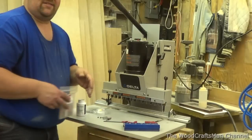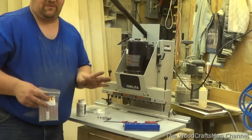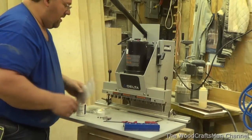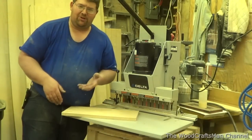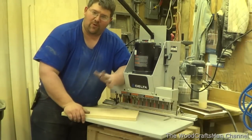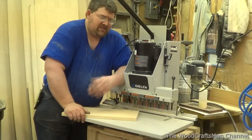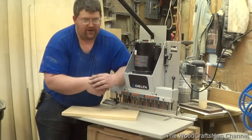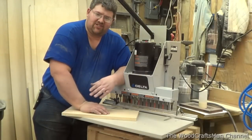So I'm going to set these bits up. If somebody is really interested in knowing how to set the bits up, I can do a separate video on that, but this is more of an overview and a demo. So, alright. Okay, so I've got done setting all the bits. If somebody wants to know a little bit more about setting the bits up, just leave a comment down below or send me a personal message. But it's pretty straightforward. The bits all have a flat spot on them, and they get inserted into the collet, and then there's a set screw that you snug down pretty good. That's pretty much it. And there's a little trick to making sure they're all the right height, but once you get that established, it's pretty good.